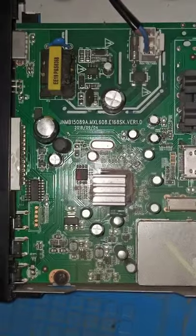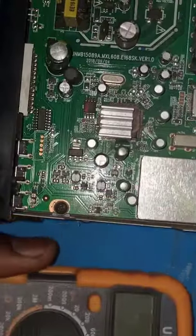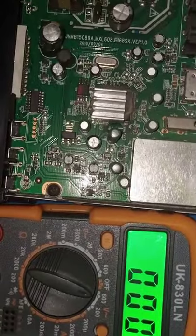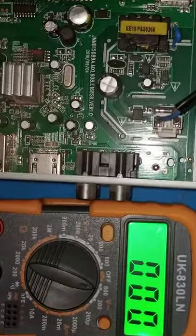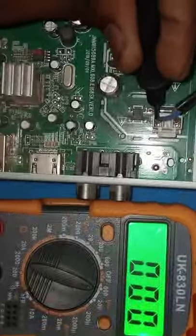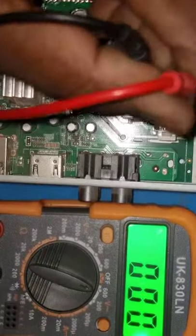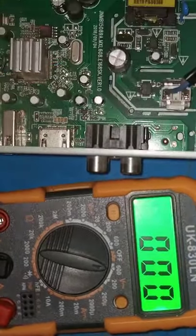First of all, let's plug it on. I have my multimeter here as well. Let me turn on my multimeter — there are my lights. I'll go to AC, then I'll check the AC input and see if there's a voltage input. With AC there's no polarity, so I can either way. Okay, I have my input voltage here — input voltage is okay.